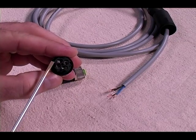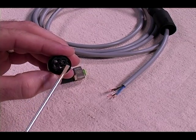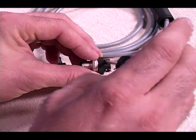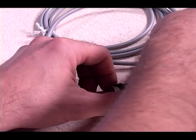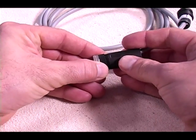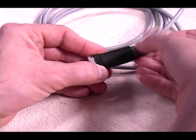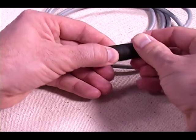If you look closely at the inside of the plug, you'll see the terminals are labeled. Once our cable wires are connected, we can slide the plastic housing up and tighten it to the plug. Then we fit the rubber grommet or cord grip inside of the housing, then the compression ring, and last tighten the threaded plastic compression nut.